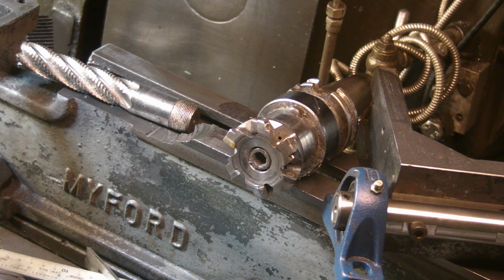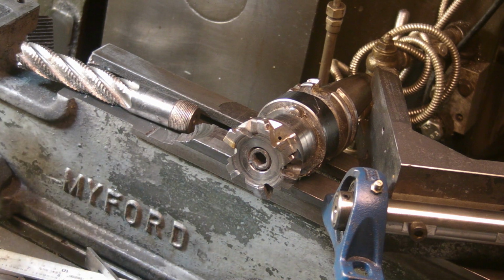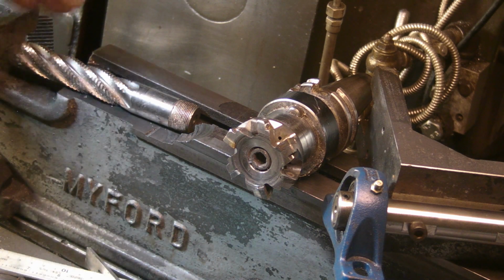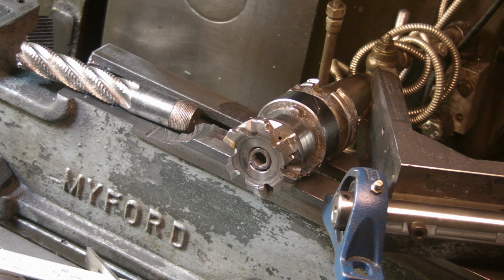I've been pricing up some brass, as I said earlier. I'd like to put quite a lot of brass on it, maybe the rosettes and other bits and pieces, the carriers that carry the guide that moves the headstock across, tilts the headstock left and right. But I've been pricing up some brass on eBay. It's a hell of a price. So I've been watching 1 or 2 videos on YouTube about melting brass. I have got a propane furnace, but up to now I've only tried it with aluminium, which has done the job. I think the melting point of brass is about 950 degrees. Videos that I've watched, they've had some success with it. So I'm going to have a trip to my local scrapyard. It's only 5 minutes away, and see if he'll sell me some of the scrap brass that people have dropped off.